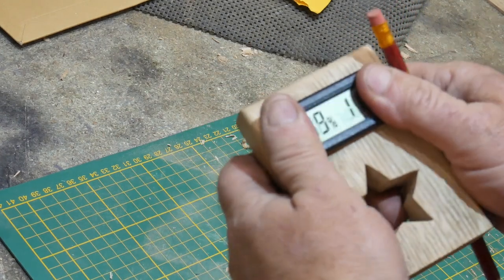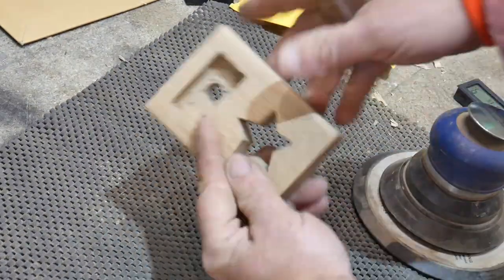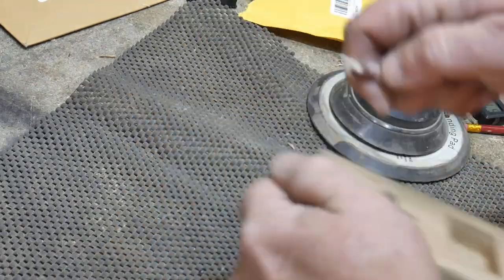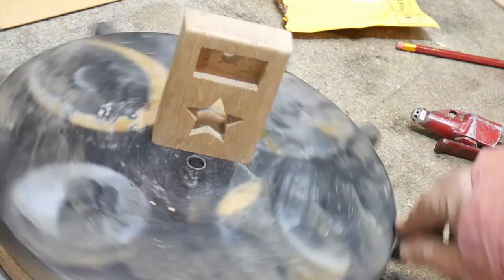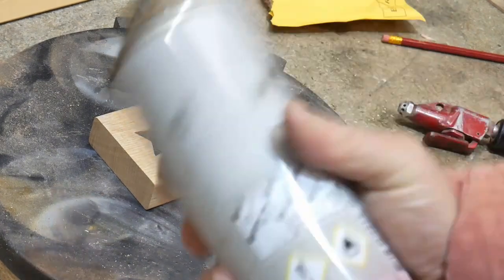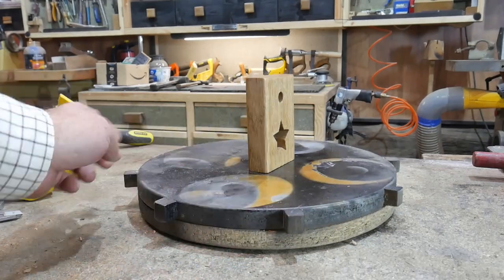And now I can put it the right way round. It's got to come out again anyway because we've got to put some finish on it. First of all, it needs a good sand to get rid of any lumps and bumps. We're preparing it - getting rid of all the sharp corners with a piece of fine sandpaper, in this case 240 grit. Then we're back on the lazy Susan that I made, so I can turn it around and spray it at the same time. First coat - clear varnish in a can. It makes it so much easier. All dry and ready to go and polished up.